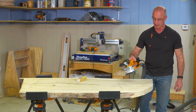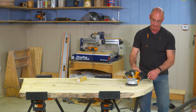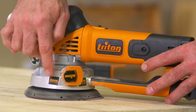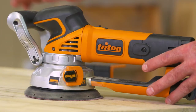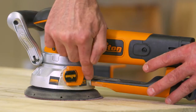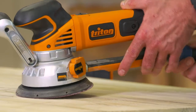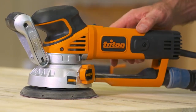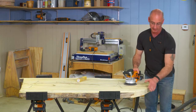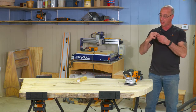I can do that with another sander. My next round of sanding I can do with a random orbit sander, and we've got some cool stuff going on here. Two settings on the sander: when it's set here, that's my fine sanding — that's what I'm going to use to get the top ready. Here it's more aggressive, gets a little bit more toward the category of an angle grinder. For what I'm about to do, I want to be on that coarse setting, and I'm going to use that to start wicking down this corner and giving it that more organic look.